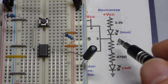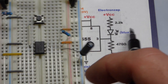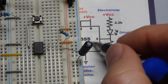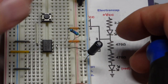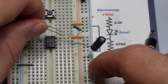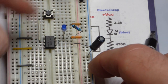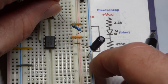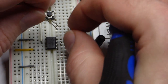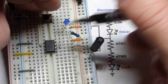For our load indicators, we're using two LEDs. The blue LED lights up when the output is low — its anode connects to the positive supply and its cathode connects to pin 3 (the output). When pin 3 pulls low internally, current flows through the LED to ground. The longer lead is the anode and the shorter lead is the cathode — on some LEDs there's also a flat on the cathode side.